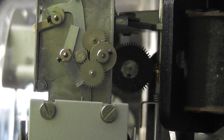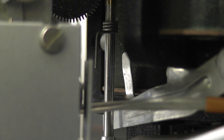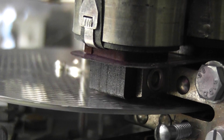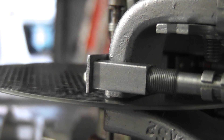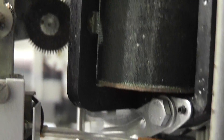Here is the meshing from the register, and the anti-creeping vane can be seen circulating around, which pulls the disc into a stationary position when there is no load or very slight load. The creeping vane lines up — the tongue sits next to the rotary shaft, so it stops turning. A typical good-quality German product, very well made. Considering it's probably about 60 or 70 years old, it's in very good condition. Glad to have this in my collection — thanks for watching; this was the AEG three-phase meter.